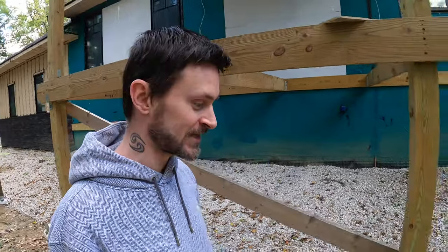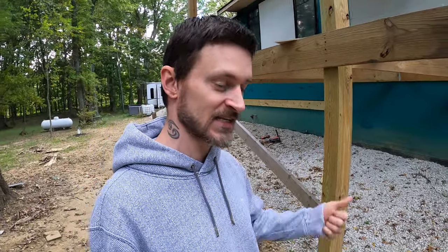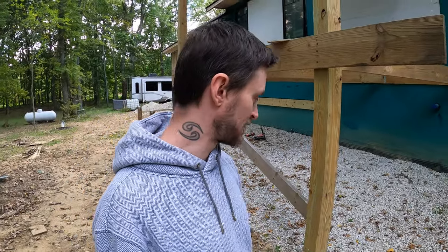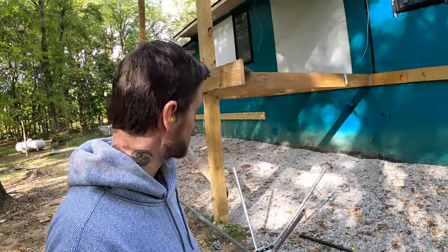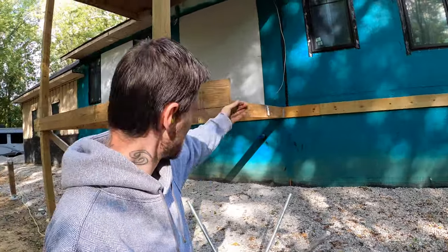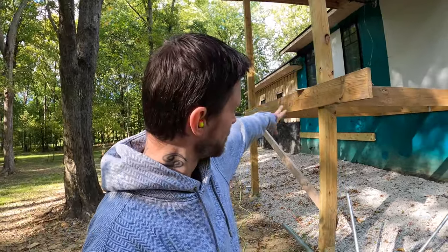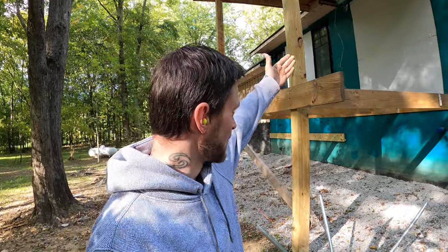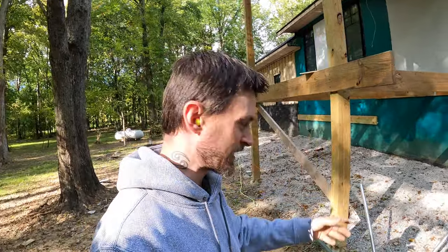So it's a good thing I started down there to begin with. Let's go ahead and get some diamond piers set up, set up a string line, and then we'll actually see what the jackhammer does to set these pins in place. All right, another diamond pier set. This one here is gonna take up the load where this one extends out a little bit like a cantilever. Again, we're still supported there on that 6x6 over there.